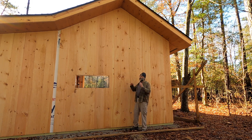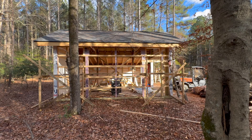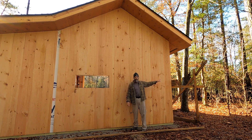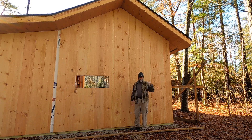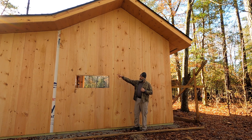What I am going to do is get things ready to hopefully work tomorrow as things dry off. I have most of this building sided. I have one wall over here that doesn't have siding yet, and I'm not going to be able to do that until I put up my fascia trim and tear down the scaffolding. So the next thing I want to do is get that fascia up so I can get the scaffolding off and move to siding on that last wall. This back wall is done, that eave is done, and the front is done.